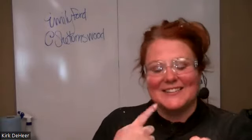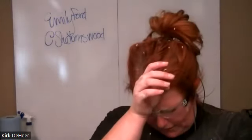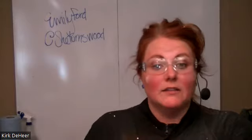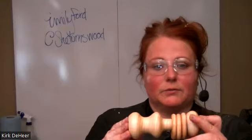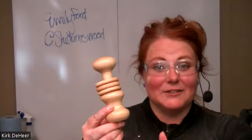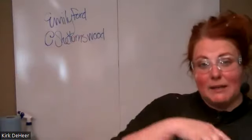Now you've got an ugly edge on this. Here's that pretty rattle. Here's the trade secret I'm going to tell all of you: the way that we finish the ends — I use my drill press with a sanding pad on it. You take a sanding pad, use your drill press with the sanding pad, and you'll have a beautiful nice rounded-over end on your rattle. And here we go — that's how you do that! I will be on after this goes live to answer any questions. Please feel free to reach out — I am 'She Turns Wood' on Instagram and Gmail. Thank you for joining me today — have a great day!